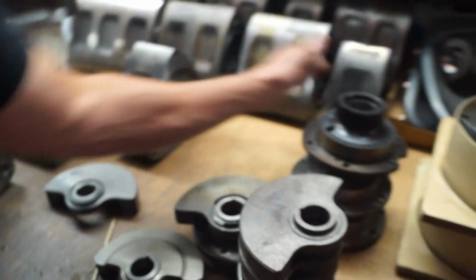They said, okay, well, we'll just do an extremely lightweight rotor and hope to put the imbalances beyond the RPM range that the average person is going to drive the car. So that's the reason why these rotors don't come balanced from the factory.